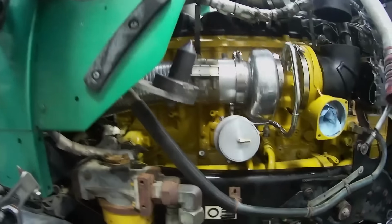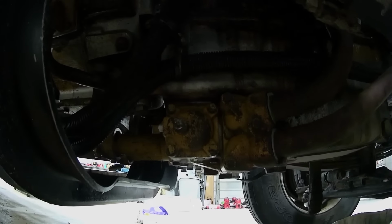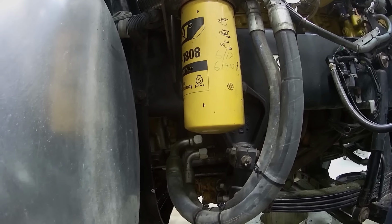Anyway, Jake got the retarder all sealed up, and what he did is he just took the valve body and all the lines off the bottom of the retarder and put new O-rings in them and sealed all that up, because I think our leaking issues are external, not internal. I don't think the two seals in the rotor are leaking. So here's the deal. Josh said these engines will run 750 before they need some work, and that's usually the head gasket.